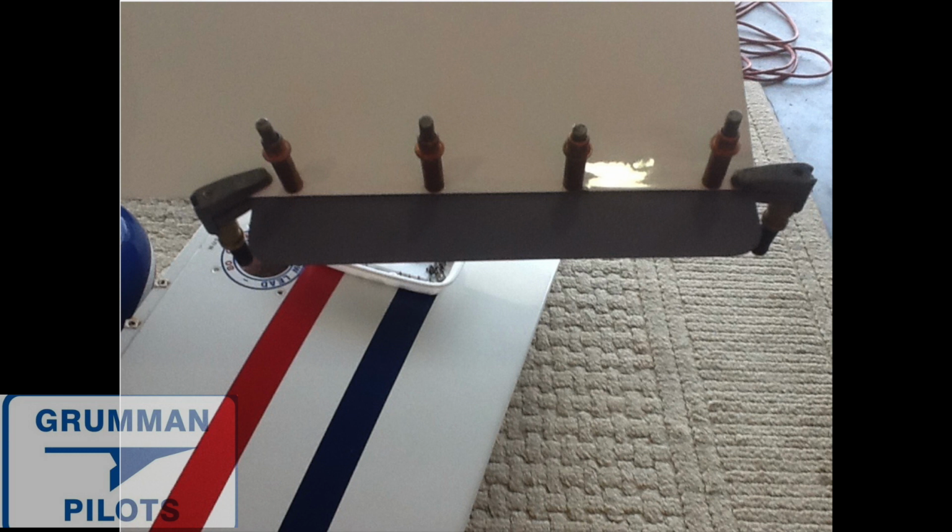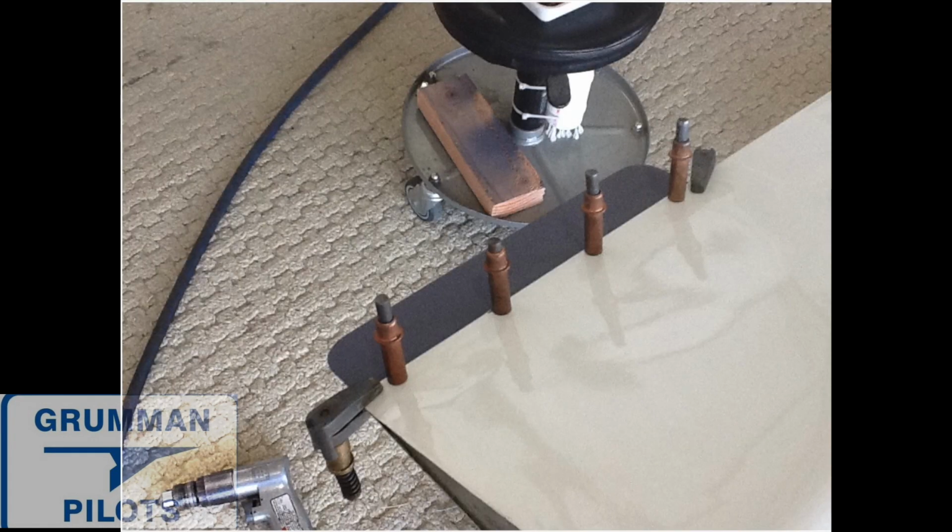Now, the airplane, after we got the rudder and all the trim tabs right and got it rigged, flew a lot better, but the vibration was more than likely in the propeller, and it was either an imbalance, in one blade weighing more than the other, which we couldn't detect, and it was supposed to go to a prop shop, but if it did, it was probably going to be rejected. The owner has taken the airplane to another state, and the current state of the aircraft we do not know.